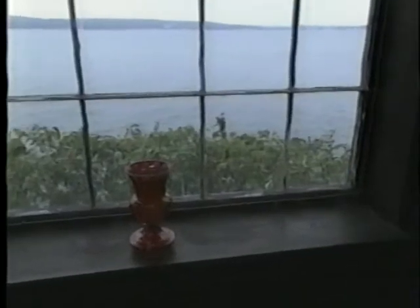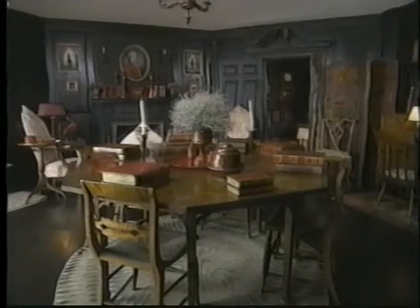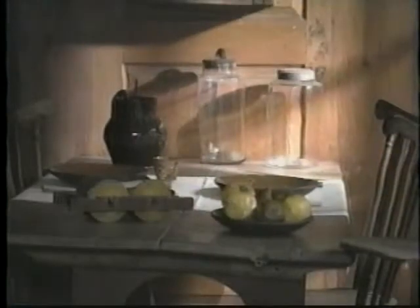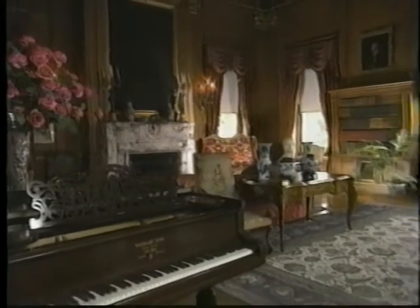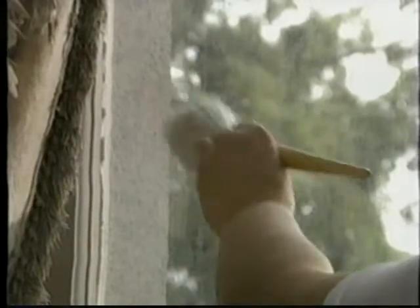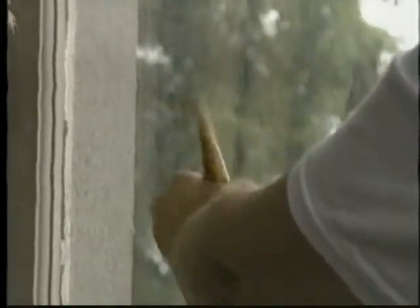On careful inspection, this window has a thin plastic ultraviolet absorbent material, or UV control film. You may also find UV absorbent materials in solid plexiglass sheets that fit over windows. Placed on a window, it is like sunglasses for a house and its collections — it absorbs ultraviolet rays, which can break down fabrics and wreak havoc with colors. It is a great material, but it is easily damaged by cleaning. Dust UV absorbent film with a soft brush and wipe with a water-dampened cloth. For heavier cleaning, refer to the manufacturer's instructions.